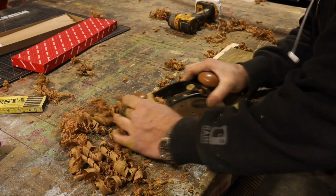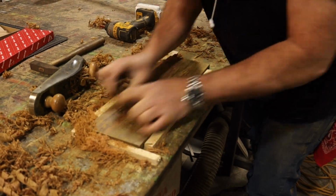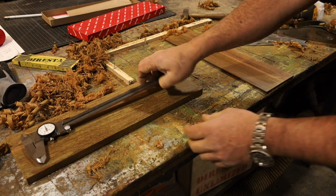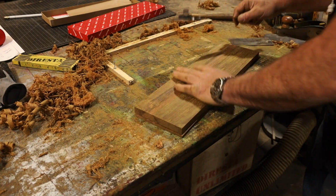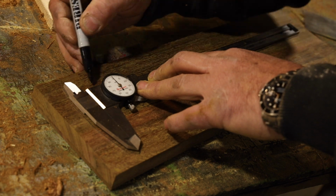See what I'm doing? I'm hand planing. I'm surprised. I figured that would be so hard and chippy. It is. There is a little bit of chip out, but those curls are from the card scraper. This type of wood is very tear-out prone, and it's also extremely hard. It's almost like working with a hard plastic. But it's nice. The grain is straight, but like I said, it really chips out. You'll notice some chip out by the end, but there's really not much I could do.